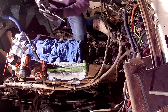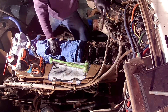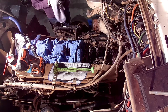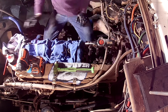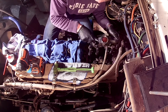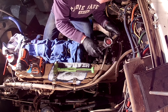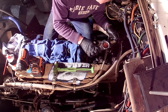Once introduced into the market, Cummins motors started having issues such as bent push rods, cracked rocker housings, bent or broken connecting rods, and severe camshaft damage. The only difference was that customers were installing the updated dual entry turbo on their trucks. How could a turbocharger cause all these issues? The answer was the difference in the amount of boost they could provide.